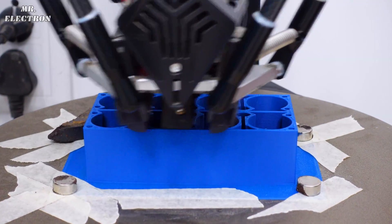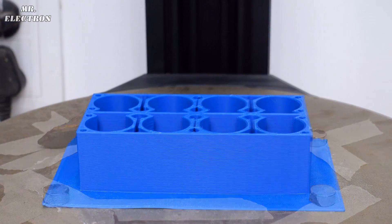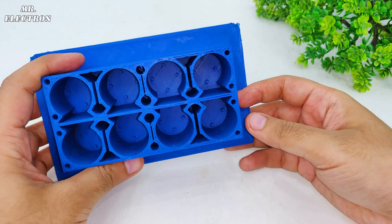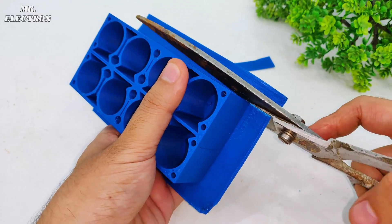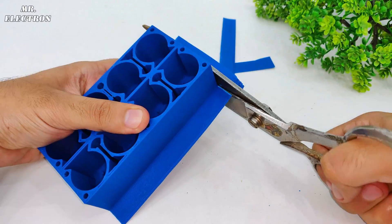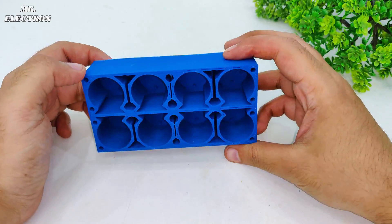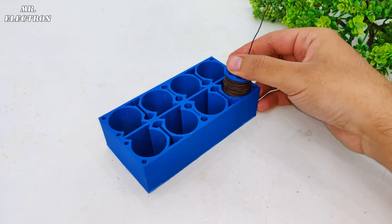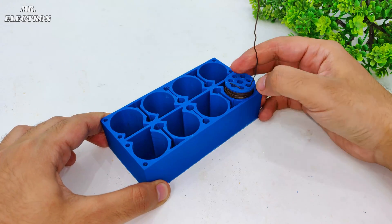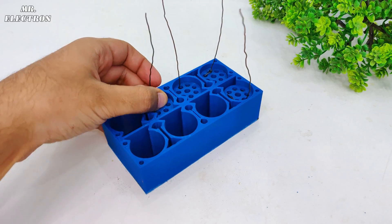Here I'm printing a battery case which is going to contain the cathode, the anode, and the electrolyte. The design looks quite good although it could have been a little more compact, but let's move on with this one. Please note that this design is not going to work with PLA filament because PLA will dissolve with the potassium hydroxide electrolyte, whereas ABS filament is resistant to it.